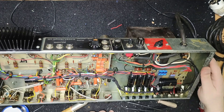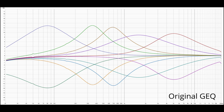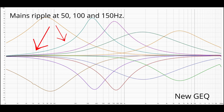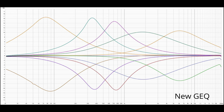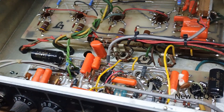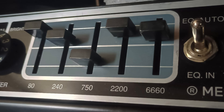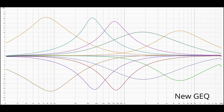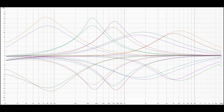And there it is — we have a GEQ. Now officially, this is a fully loaded XHRG. Here are some measurement graphs from another original GEQ, and then this new one. As we can see, the new one is a bit cleaner due to the new filter caps, and the cut and boost ranges are bigger, surely due to the brand new components and transistors on the driver board. It also matches the stated center frequencies a bit closer. The numbers on the front panel are never exactly matched, as each frequency is determined by a passive RLC network, and tolerances — especially in inductors and capacitors — can make a decent shift. No two GEQs are exactly the same.